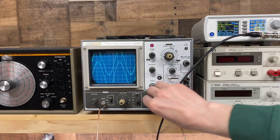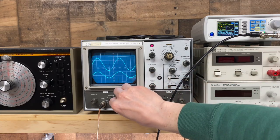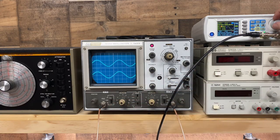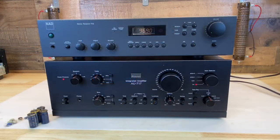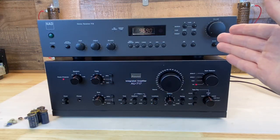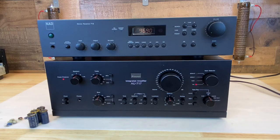The manual says it should get about 85 watts per channel. We'll see if we can hit that. Clipping there — that's closer to 100 watts, but we're definitely getting our 85 watts. This is great. I'll button it back up and let's do a final sound test. I'll use this NAD712 stereo receiver as a preamp for the final sound test. Thanks for watching.